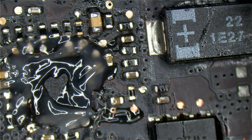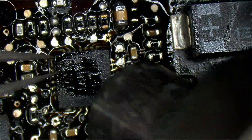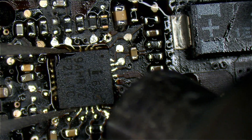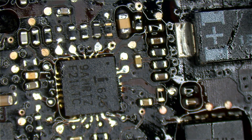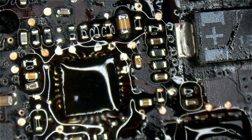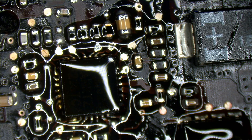The Weller should be hot by now. The nice thing about the big nozzle is it's easier to heat the entire chip all at once and easier to move the chip over. I'm going to move it to the side a little, then add a bit more flux. I'm also going to lower the hot air temperature because I put it really high — I have a tendency to crank the temperature on the Hakko and the Weller because I don't like waiting for them to get hot. That's a bad habit of mine.